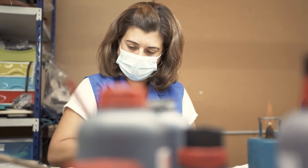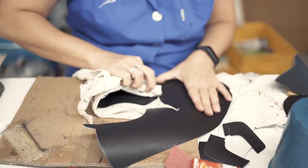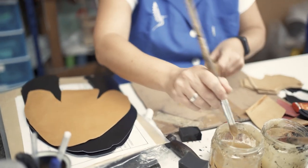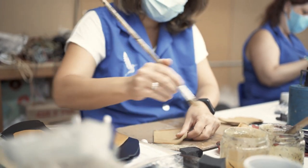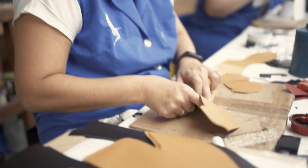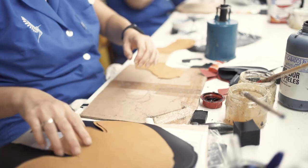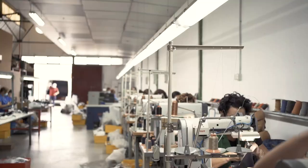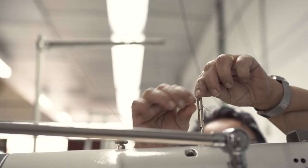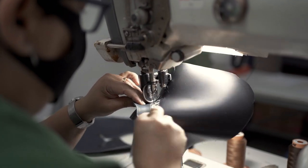This is Monse, and after cleaning up those edges she's painting them black, making sure the entire upper of the shoe looks black. Right here she's gluing a couple of different parts of the lining together. That's a common misconception in shoemaking — people think that shoes that are fully stitched including the outsoles have no glue involved, but every pair of shoes still has glue. You've got to glue the parts together so they don't move around while you're stitching them.